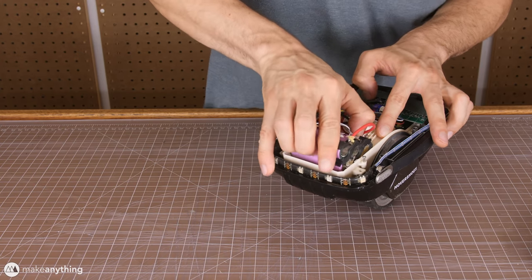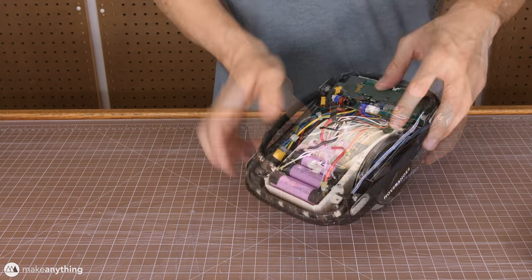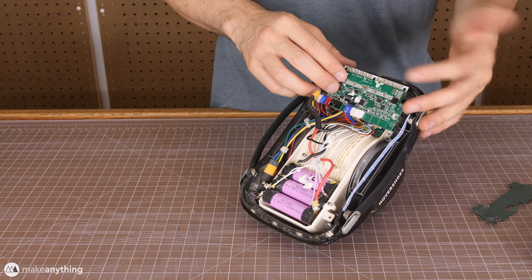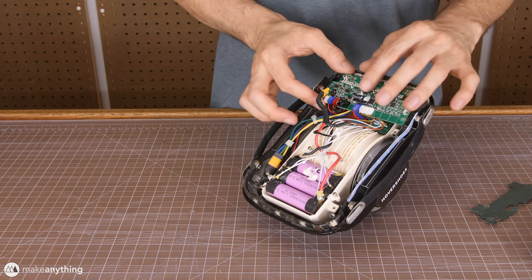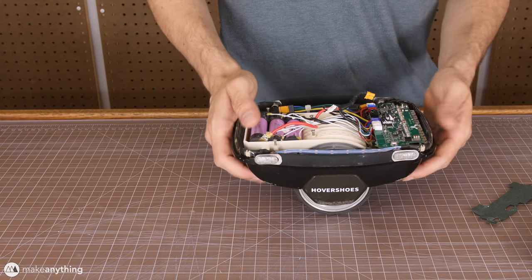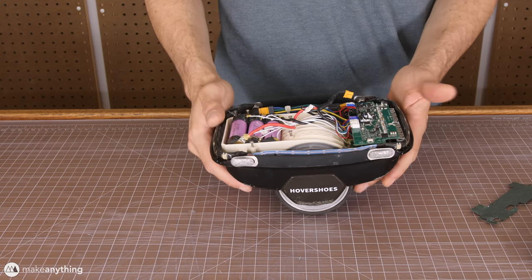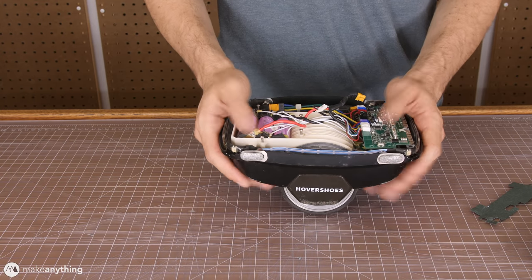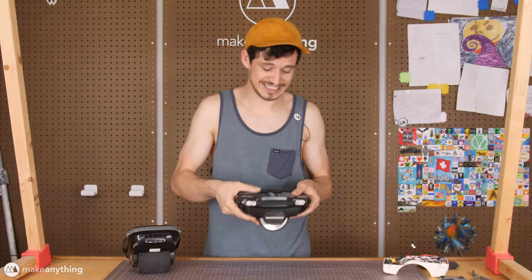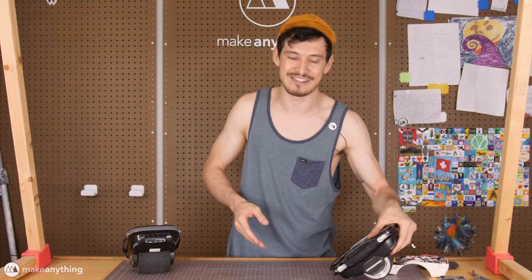The fact that these five little batteries can move around a human for 45-plus minutes is pretty impressive. But what really makes this thing work is the circuitry — on these PCBs somewhere we have an inclinometer, which is basically a tilt sensor that lets the hover shoe know if it's leaning in one direction or another. If the shoe starts to tilt, the wheel will quickly move in that direction to catch its balance. As long as the rider keeps leaning in one direction, the shoe will keep moving that way, and if they stand up straight it'll do its best to stop and stay balanced.